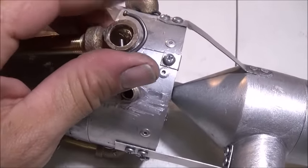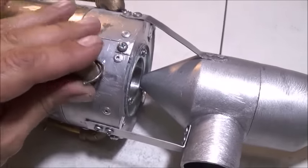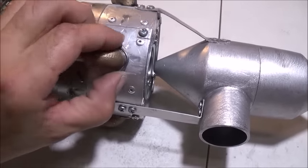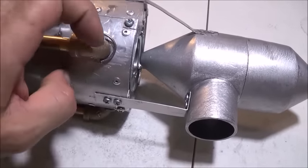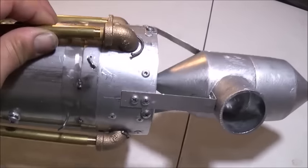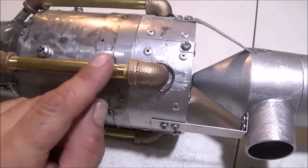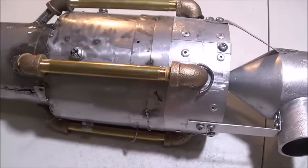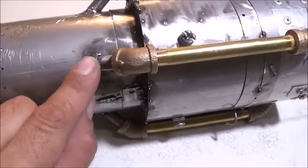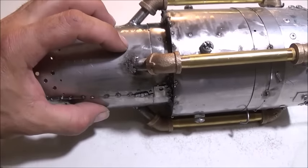You can see how the d-ring works — you rotate it onto there, expand the d-ring a bit so it can go on, push it down, and with a pair of pliers clamp down that d-ring so it seals on there and won't come off. With a little high-temperature o-ring or gasket we should be able to keep a nice airtight seal. Down at the bottom they're actually welded on, so the four pipes will always be attached to the actual ramjet portion of the engine.